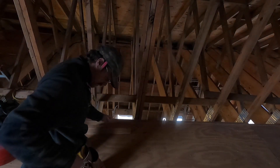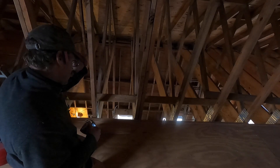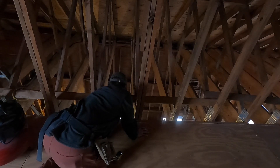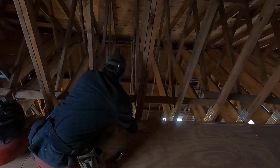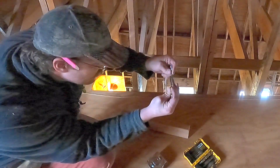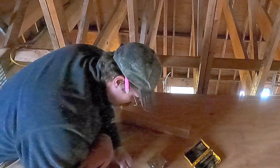This will be 10 feet in and 10 feet over, then 20 feet spacing. I couldn't find any ceiling boxes at Lowe's so I'll have to come back later and put ceiling boxes in. The floor is supposed to be 20 feet but it's actually 19 feet wide, so I'm going to measure off six inches on the floor here. I've gone down and measured 10 feet in — that's about two to three inches over. I'll just make a mark here. I'm going to use this quarter inch drill — that'll be perfect.